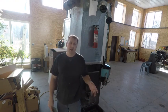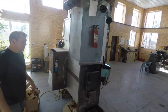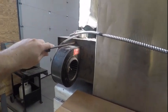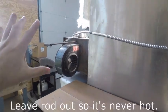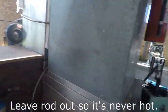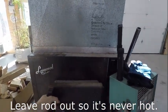I'm just going to cover basically day-to-day operation of this furnace and how I use it. The first thing that I do - let me pick you up and show you - is I move the reclaimer cleaning rod. Here's the heat reclaimer and it's got this rod on it; I just push it in, only takes one finger, it's real easy. You don't have to do that every time, but I do it - takes all of no time, so why not.